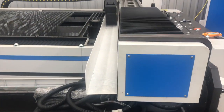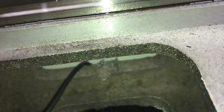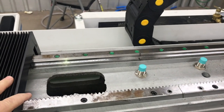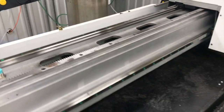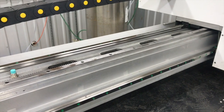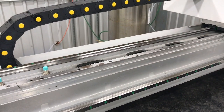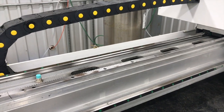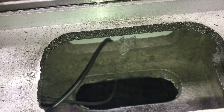Let me get this apart and take a closer look. Alright, got that loose. You can see the wire looping over right there. As I've shown many times, a lot of parts of this casting are very rough — a lot of the openings still have casting flash. I'd like to see them do a little more machining or hand finishing in certain areas, but more finishing work means more money. I'm going to cut that wire — it looks like it's just looped through there and really shouldn't be — cut it and re-splice it, and we'll see what happens.